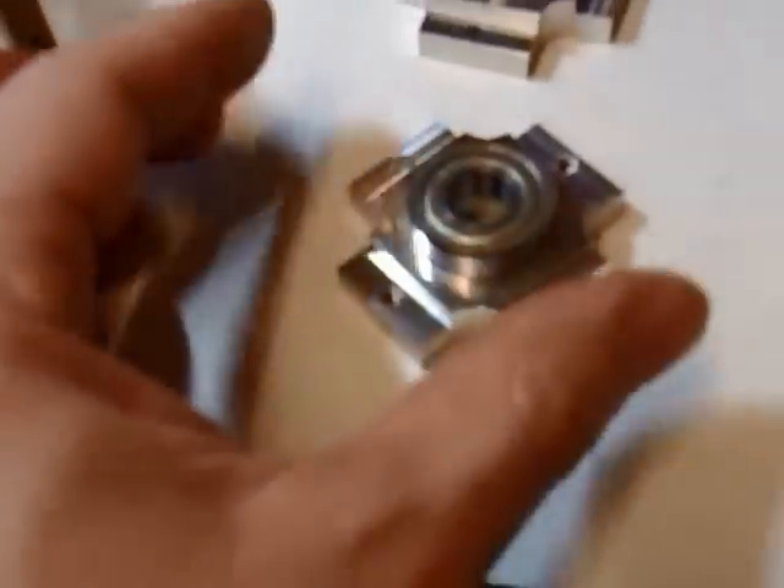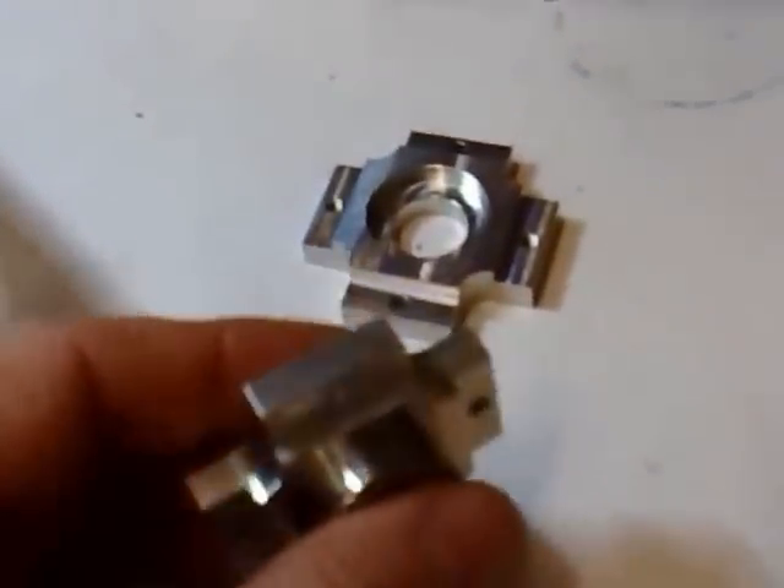As you can see, it will fit nice and snugly into this housing and you can simply press it into place using a standard vice, which I shall show you now. So I've just slightly pushed it into the right location, and just by lightly turning the vice, it will locate and seat into the main bearing housing.